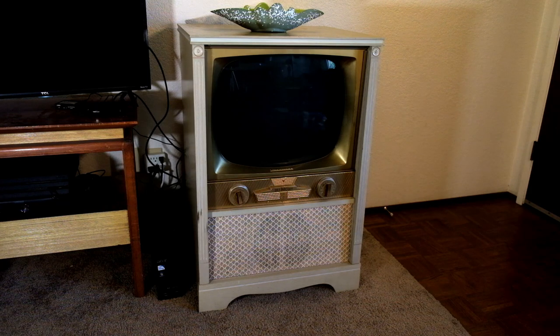I found this and it was in fantastic shape. In fact it even has the owner's manual and the little hanger tags that go on the knobs that were on it when it was new in the showroom. Unfortunately the flyback was bad and the CRT had been out, and this used a very early 21-inch low deflection angle CRT. Given all of the issues put together, I decided I'm not gonna invest the time in it.